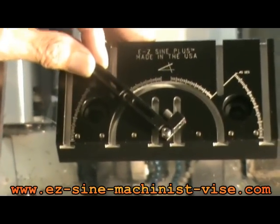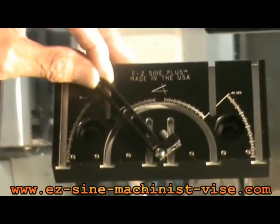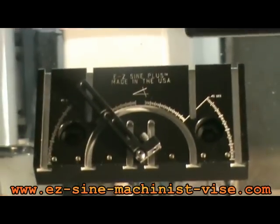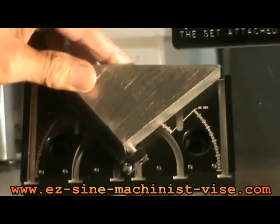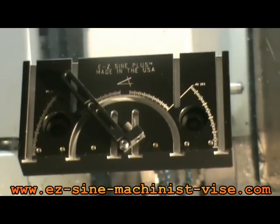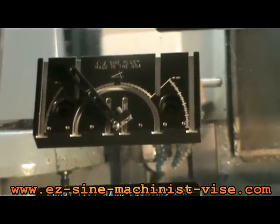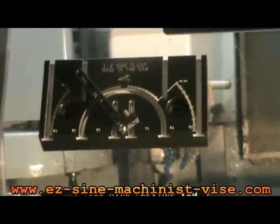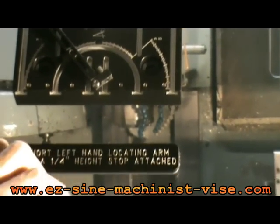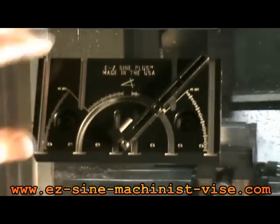So here we have 45, 46, 47, and so on. I have a piece of material here at about 43 degrees, just to give you an idea how it works. There it's set up — that's how you hold the part to machine the angle. On the second angle jaw I have the right-hand long locating arm, which is capable of holding a longer part. The short locating arm is for milling close to the top of the vise, while the long arm is for a larger part that you need to hold to machine an angle.